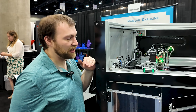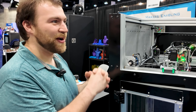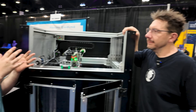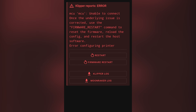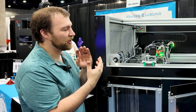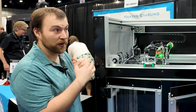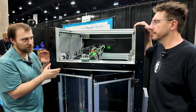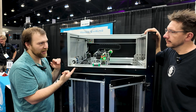In particular for Danger Klipper, they've added a lot of the error messages I suggested. Standard Klipper used to tell you 'hey, you had an ADC error' — which means a temperature error — but it wouldn't tell you which one, how to look at it, or what the problem is. Danger Klipper now tells you which one, what value it saw, and why it thinks it might be broken. The logging in Klipper is very powerful. Once you have an operator that understands it, I offer on-site training to troubleshoot, go through configs, make modifications — and the logs are powerful for determining what happened and why.